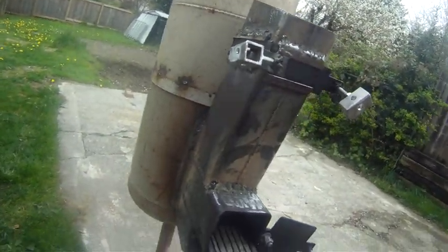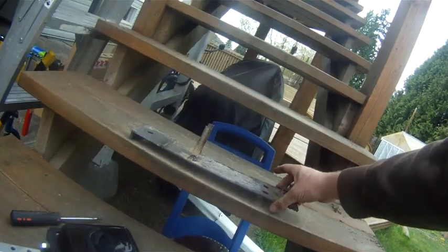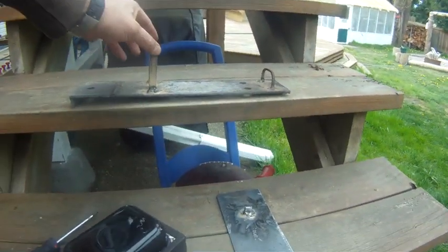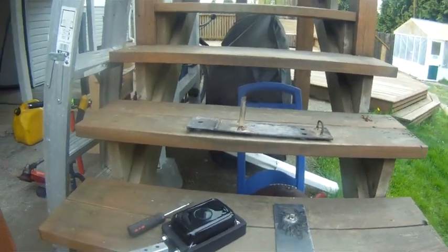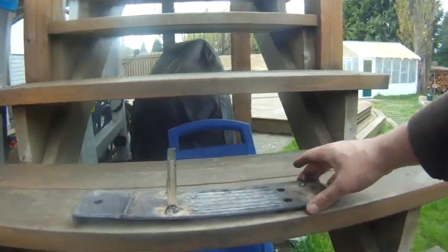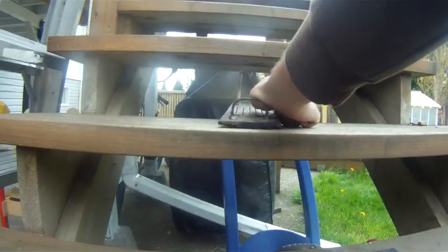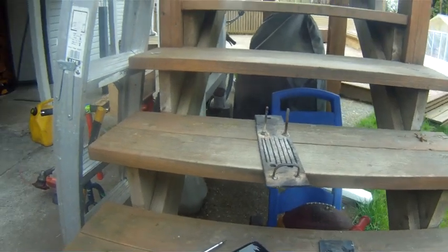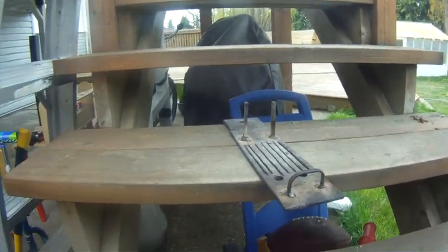Here's the final grate. It's got two little prongs that keep some of the larger coals from getting blown forward prematurely — holding back the larger stuff. It's also on an angle so the front is higher. My secondary air intake is there. Just two little tabs on the back to make it sit up about a quarter inch, and a little handle to keep the ashes from falling backwards and to grab onto as you slide it in and out.